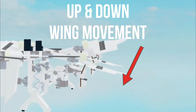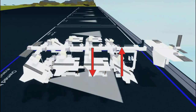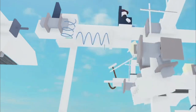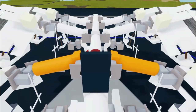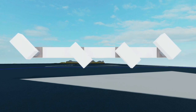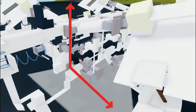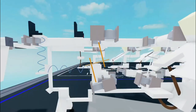The next topic is how the wing moves up and down — not just randomly, but with coordinated movement combinations. When one wing goes up, the other wing goes down, and so on. This movement is controlled by something similar to an engine crankshaft, placed in parallel by connectors and suspensions to hold them so they won't rotate and only move linearly. This crankshaft is connected to a connecting rod, which is then connected to a wing holder. The crankshaft rotates at the exact same speed due to the connectors and their positions, so that the wing motions cancel out each other's momentum and air drag, reducing lots of unstable movement. Unlike a connecting rod in a piston engine, this connecting rod runs in two different axes: the first to overcome the different wing holder rotation, and the second to overcome the crankshaft rotation.